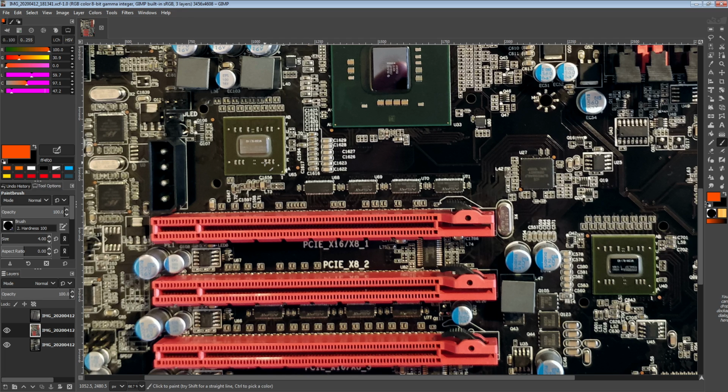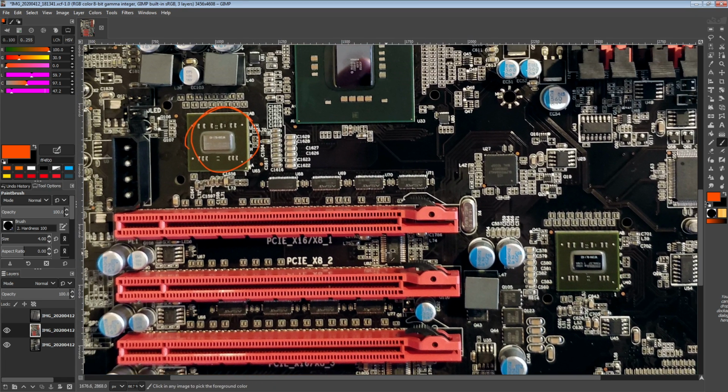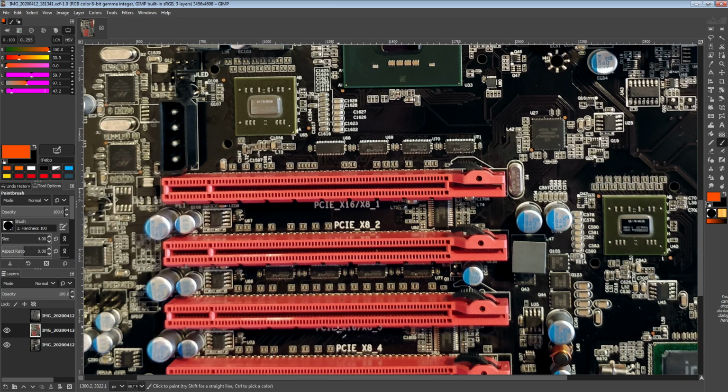There are a lot of motherboards out there that support quad SLI and don't have a pair of NF200s, or come anywhere near the number of PCIe lanes that this motherboard has after the switches. But with X58, NVIDIA was like, well, we make NF200s, and outside of dual GPU cards, there's not really much you can sell these with. So just force motherboard vendors to use them for quad SLI support. So, yeah, that's why we have two NF200s here. And that's why it's also converting the 32 PCIe lanes from the I/O hub all the way to 64.